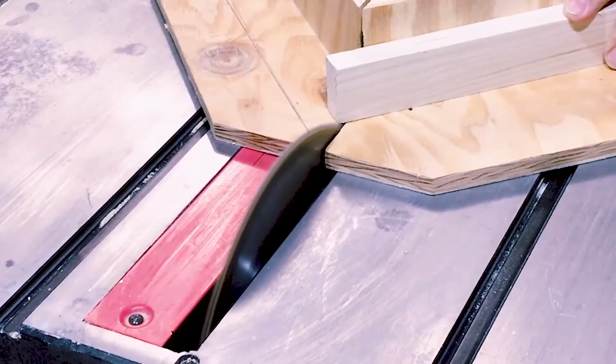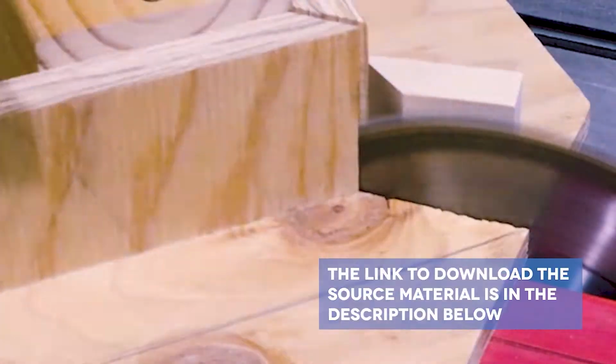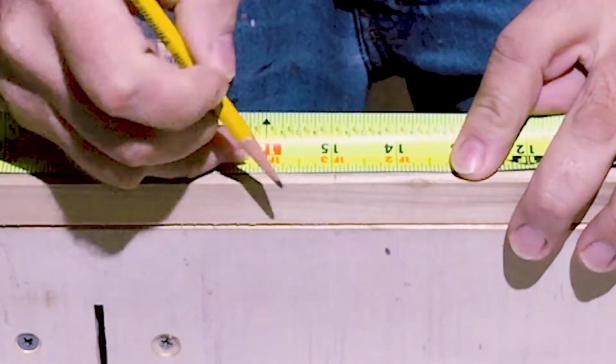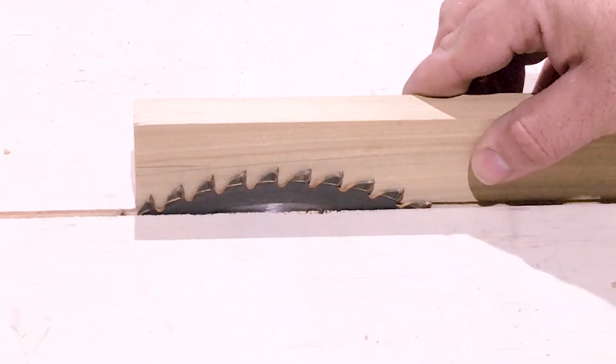Once the pieces were cut, I immediately moved on to the 90-degree sled, cutting the mitered ends on side 1 and 2 of the outer wall stock. Next, I set up the cross-cut sled on my table saw to cut the dado grooves out of the outer wall pieces. The dado grooves are what will lock in all the cross brace pieces when fully assembled.